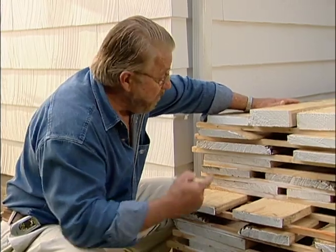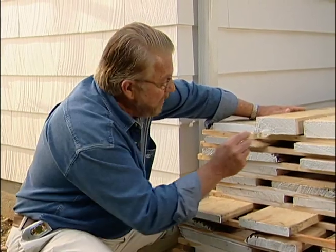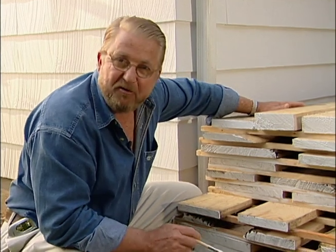Well, my tree has gone from logs to lumber, but before I can build anything out of this, I've got to dry it. Now, the ends of a plank dry out more quickly than the center, so I'm applying some latex paint to slow down the drying on the ends and prevent cracking, which could cause me to lose some really useful lumber.